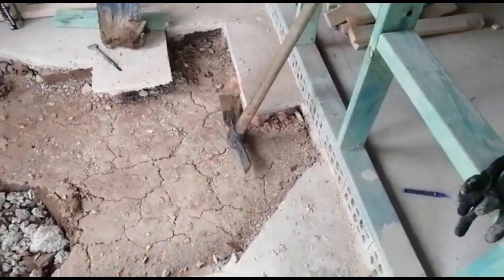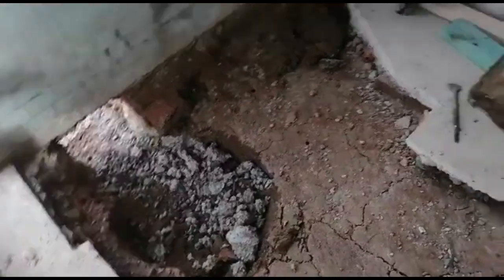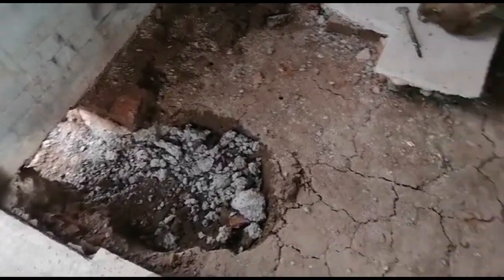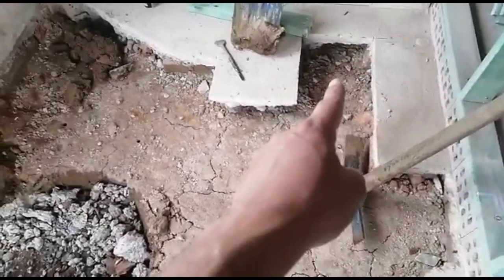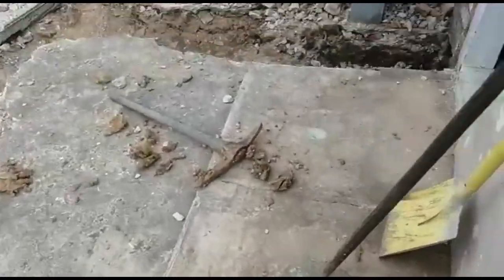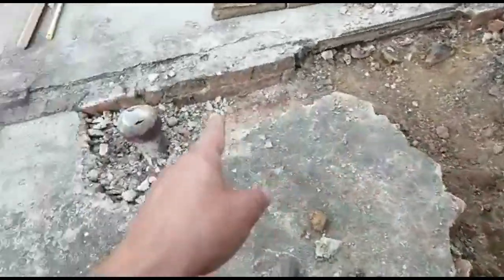My father-in-law is a legend - he cut concrete, removed it, and underneath is just ground, obviously soil. The slab wasn't that thick. We still got to dig all of this out to depth - the appropriate depth is about 250 to 300 mil deep below the concrete level for the plumber. I'm gonna have a drain up in that wall there for a future kitchen, shower waste, floor waste with a big junction, laundry sink waste, and toilet waste. On the outside, we came underneath and I'm gonna have a drain here because I might put an outdoor sink here for a barbecue. Going to run sewer here and then connect there.